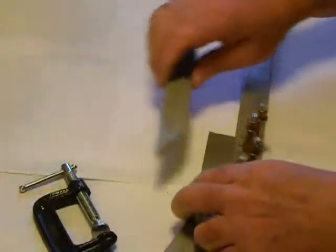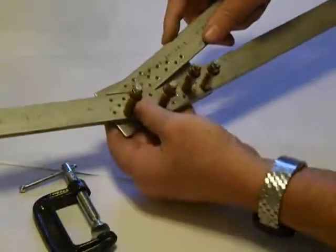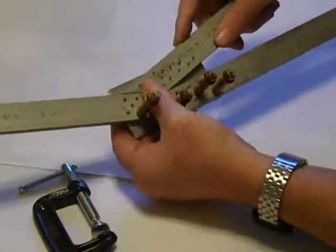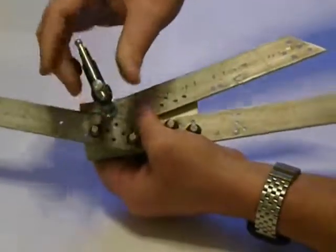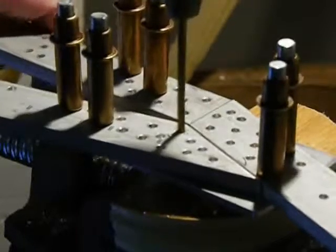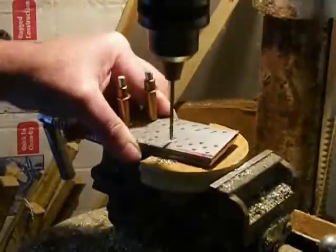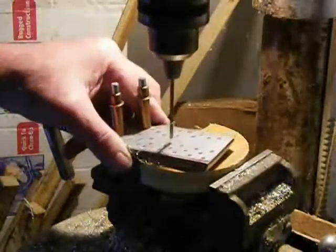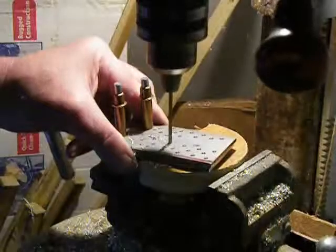This is how the upper ascending arm fits. Notice how one corner meets up with the top corner of the other two parts. And then I'll clamp it. Now I'll drill the third set of holes in the side plate. Now that the first side plate is completely drilled, I'll use it as a pattern to drill the other three side plates.